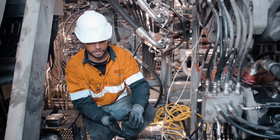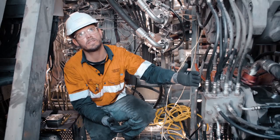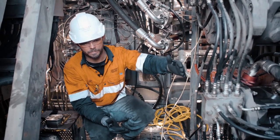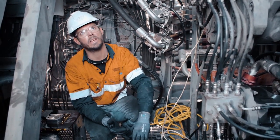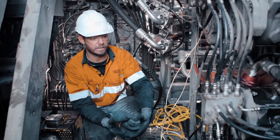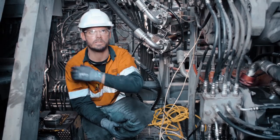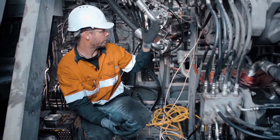On the electronic control, it's set to ramp on smoothly over 15 seconds — a smooth application of load. For safety reasons, as you pull that lever down, it ramps pressure off in just one second. And if anything is ever not right or goes wrong, there's also an e-stop which will dump all pressure immediately.